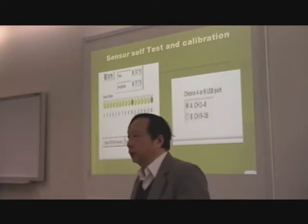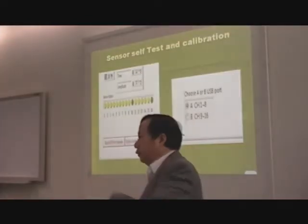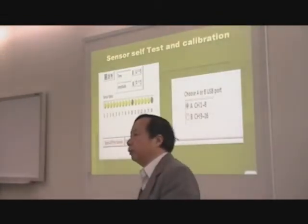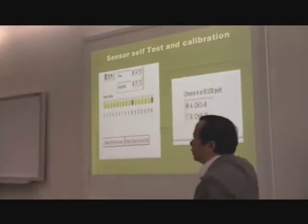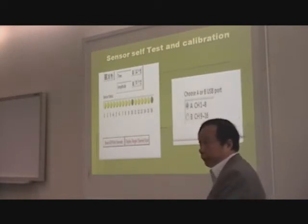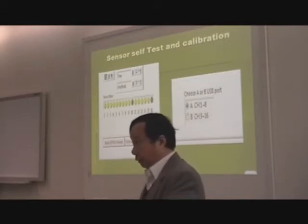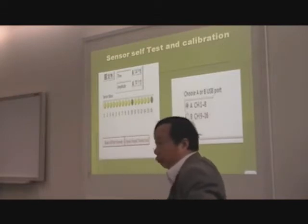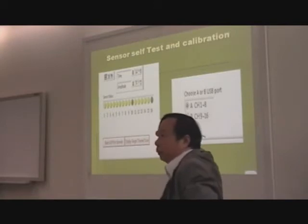And the first 6 sensors installed were all destroyed because they went through a right angle bend, and the signal still showed up but about 100 times weaker. And so we know that the sensor exists, but something was affecting it. It took us a couple of hours to figure out what happened. And then we asked them to cut out the wrapping, and we discovered these right angle turns. Luckily, we have 6 extra sensors. We installed those, and that is what got the picture you see today.